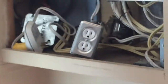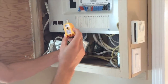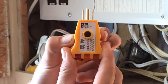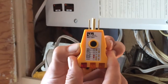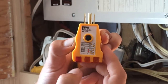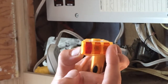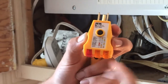This one is just a plug-in tester. It's very good for testing to see if the circuit is okay. There are many different options indicated on there: open ground, open neutral, open hot, hot-ground reverse — which is crazy, I've never seen that before, it's a bad indicator — and hot-neutral reverse, which I have seen. Then there are the two amber or orange colors on the right side. If those are lit, that's perfect. Any other combination is bad.